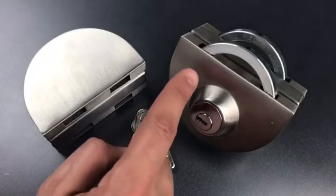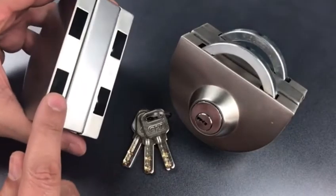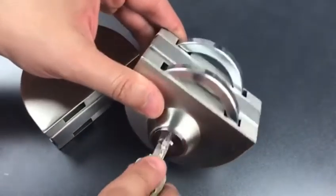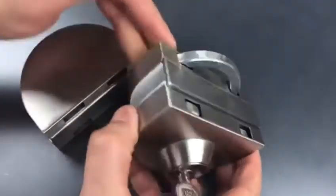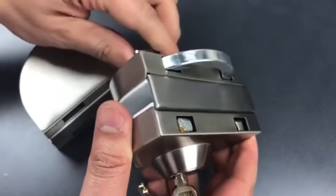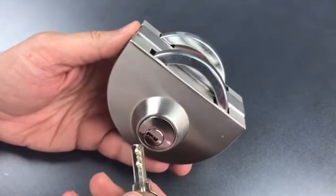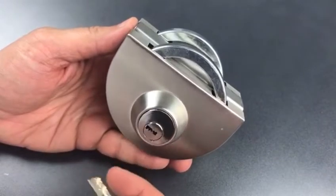Designed for double glass doors with a circular bolt which positively interlocks with the other door. Now aside from the circular bolt there's something else very strange about it that I'm sure locksmiths see right away. If you lock it from the outside you are unable to unlock it from the inside, and vice versa — if you lock it from the inside you're unable to unlock it from the outside. This would violate pretty much every fire code in the world because it's capable of locking someone inside without any means of escape.